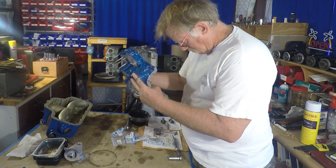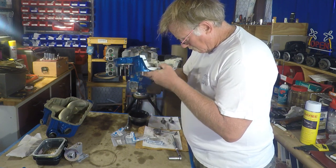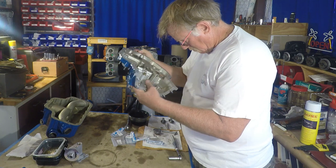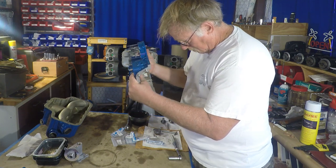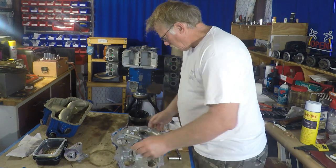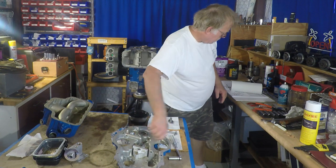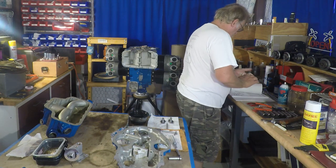Now, I did the low end torque on this one, and what I'm looking for right now is to see if the safety wire holes are lined up with the castellations on the nuts. Now, on this particular one, yep, check for twist. Make sure everything's still loose. Looking up the final torques and all that.